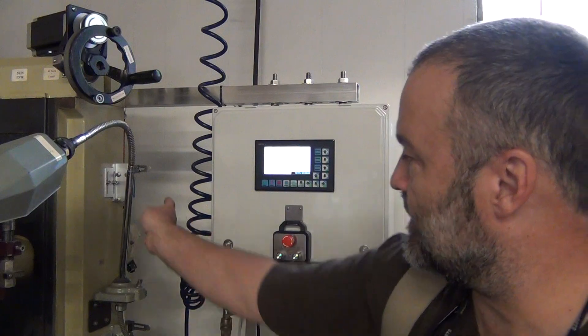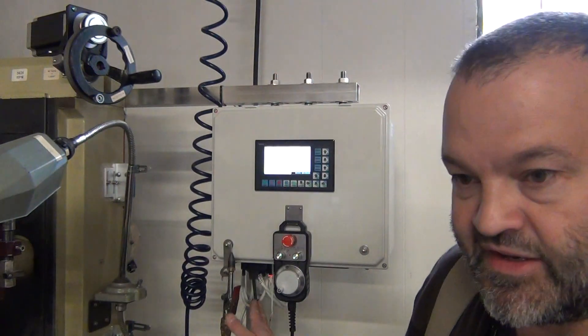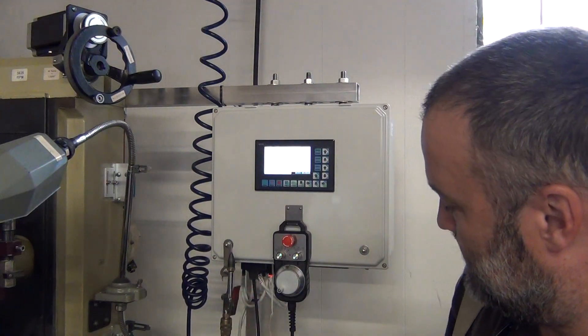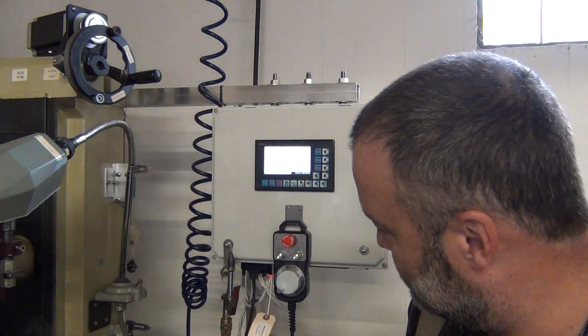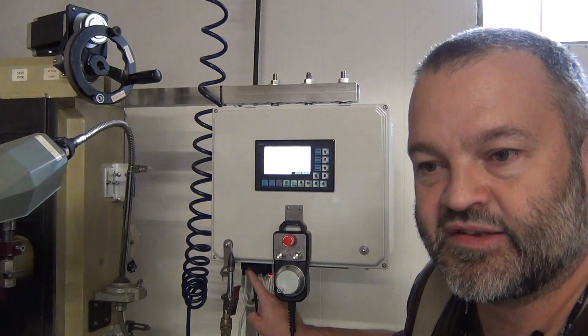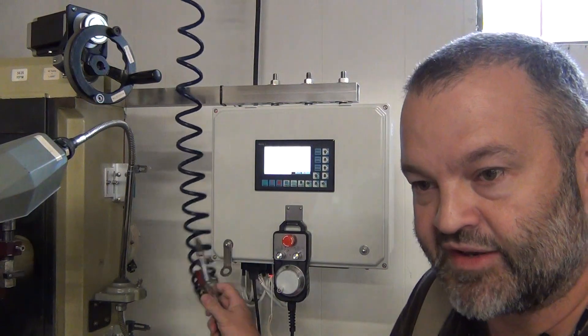You can see back here are some of the limit switches that protect the Z-axis from over range. A properly executed program would never hit the limits, but they are there for safety purposes. All those limit switch signals go back here. All the stepper motor signals come out of here. The MPG pendant — I've got it wired to a 25-pin D-sub connector.